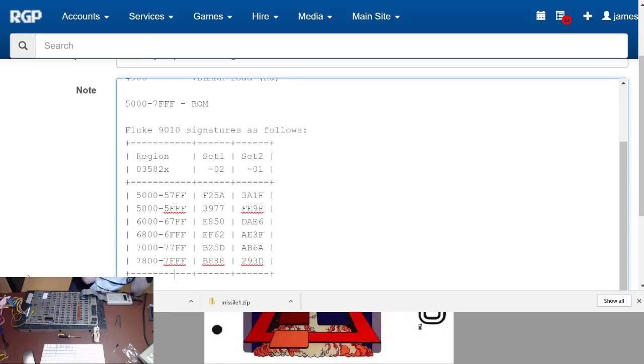Now, I had this before. I had this previously. ACBF. Do a bus test. Yeah, you see, I'm still getting this error where it says data bits are tied on the bus. So that's why it's not reading. The reason it's not reading the ROM is because it thinks that the CPU isn't reading correctly. Data bit one tied. Bus test okay.